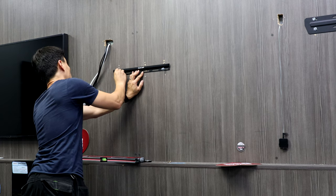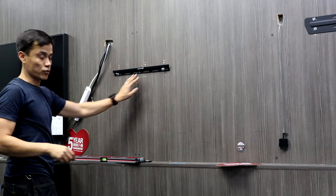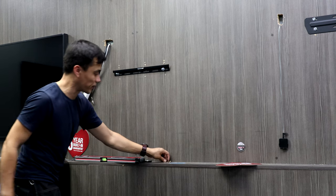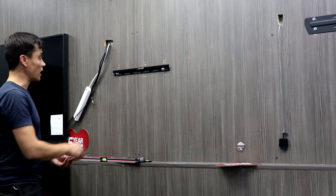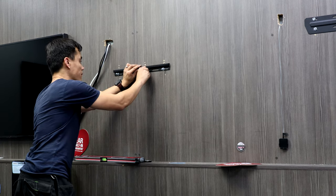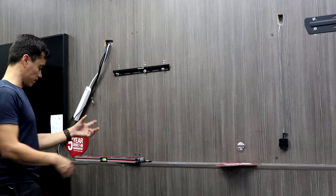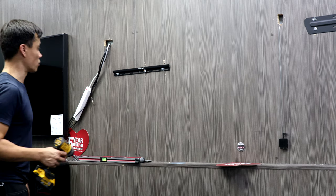But whatever the wall is, make sure you've got the appropriate fixing. If it's a brick or a breeze block wall, so say you've got plasterboard, little cavity, then breeze block or thermal blocks, whatever they put in nowadays, I would use concrete screws, so you drill a pilot hole. I'll put a link in the description so you can have a look, see what they are. But again, I use them for brick as well. I don't like the big bolts with the raw plugs. I always find you could pull the TV away, so concrete screws would be best.